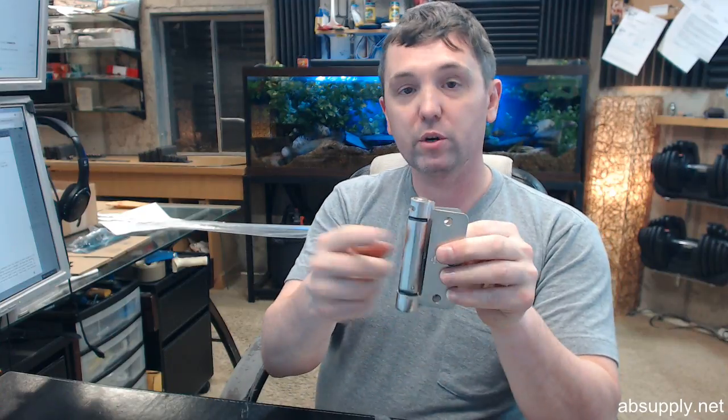For a ninety pound door, go with all three spring hinges. I'm a fan of all spring hinges — and it's not because I'm a distributor of spring hinges — as much as my experience has taught me that when you have more spring power on reserve doing the job, the more effective, predictable, and reliable operation of the door you'll have.